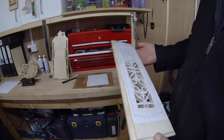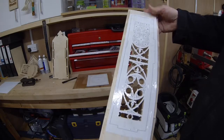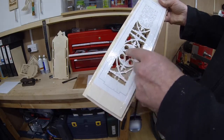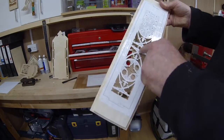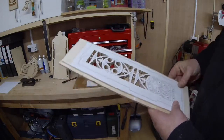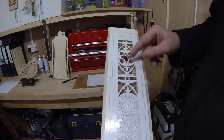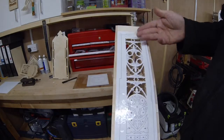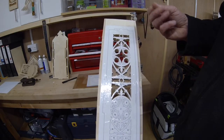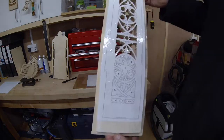I'm about two-thirds of the way through this last piece. I've used a large number-five blade for these larger cuts, and then dropped down to a number-two for the smaller ones. Personally, I don't think you could do it all with the small blade — the small blade seems to wander more. While they're big cutouts you might as well use a thicker blade; it stays in line better.